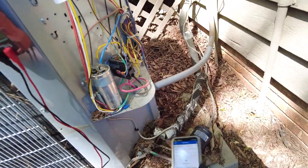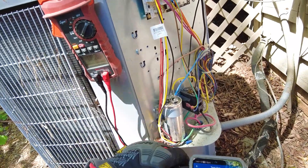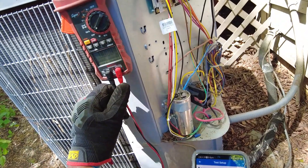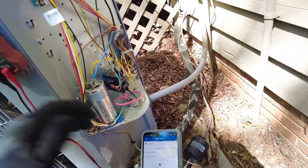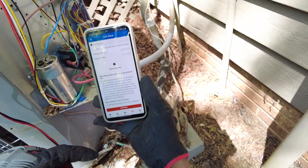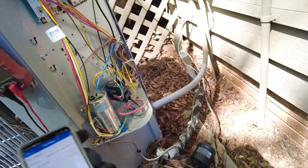Welcome back. Today I'm going to go ahead and test the capacitor on the load using this here Subco Redfish meter — pretty cool meter actually. It does power factor and different things like that. It's actually a power meter. But I'm going to just quickly show you how I go about using this meter and this app to test my capacitor, both the fan and the hermetic side under load.